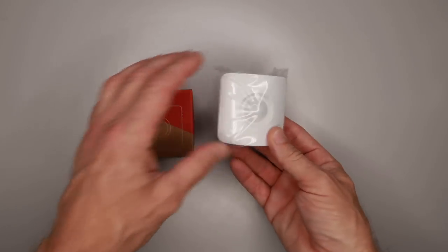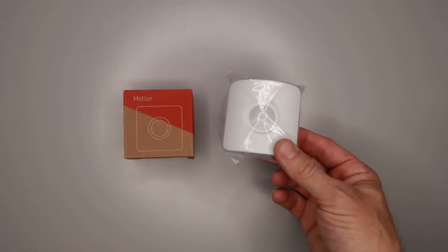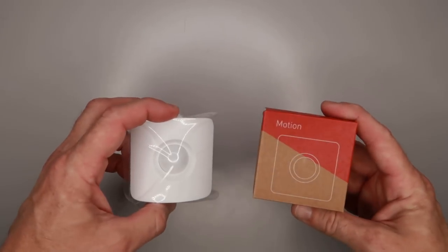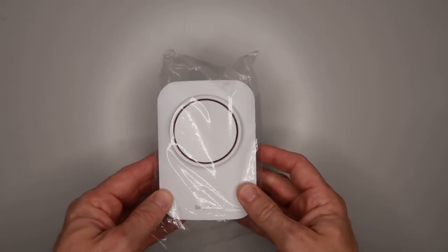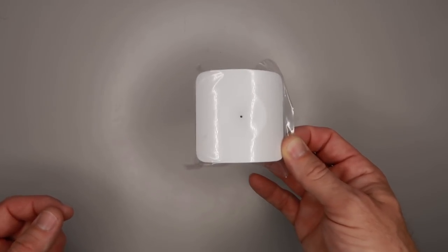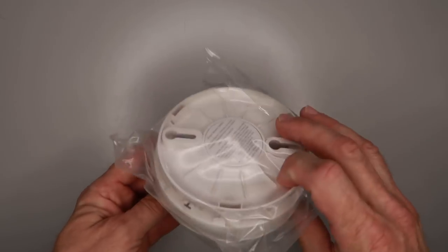With a lot of the packages you get the motion sensors included. These can be put in the corner of a room or mounted flat to a wall. The idea is that animals under 40 pounds won't trigger this. In my house I have a 92 pound dog, so we can place these in different points upstairs — this one goes in the master bedroom and this one in the hall. They're handy but aren't a necessity. You do need the base station, the sensors, and the keypad to arm. Some other included items: a 105 decibel siren I can put upstairs for an additional alarm. There's a panic button for upstairs. I do have stained glass doors, so there's a glass break sensor — if it hears the sound of glass breaking it will set the alarm off. And I have a smoke alarm that will trigger an alert if it goes off.